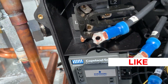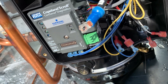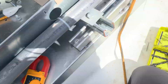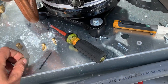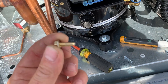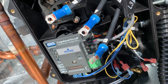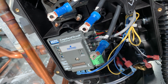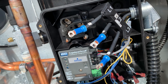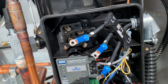What we did to fix this is I chopped these off to roughly as far back as I could. I'm gonna trim the ears off that one a little bit more. I went through with a pilot bit and then a drill bit that was slightly bigger than these screws — I don't want these to thread through there, but I want to get as much surface area touching as possible. So that's what we're gonna have to go with on this repair. I believe that this is going to create good contact. It's not ideal, but sometimes you got to do what you got to do.